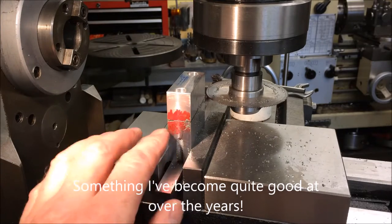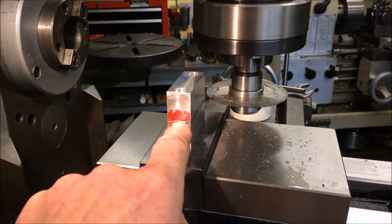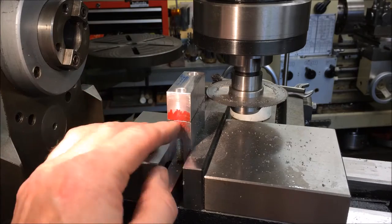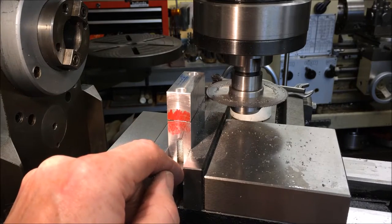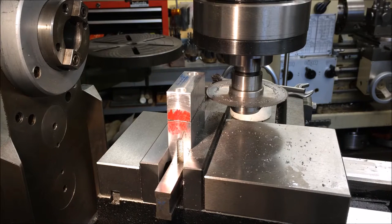When things go wrong you have to try and find a way around them. I know at this end of the cut I've got some teeth in there, so what I'm going to try and do is go down here so far and come this way as far as I can, then see what's left and whether I can get through. Once I've done that I'll see what's on the faces once the two blocks are separated. That's going to take quite a while because I'm taking a shallower cut, so I'll bring you back in towards the end and you can see I've already made a bit of progress.